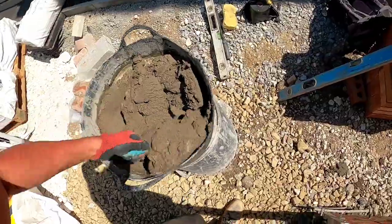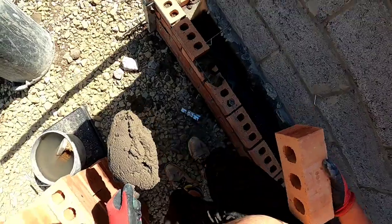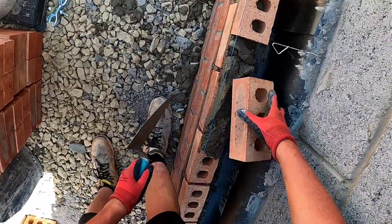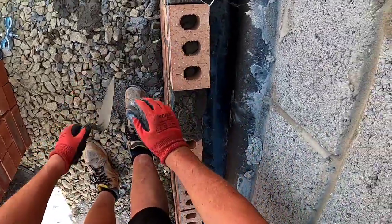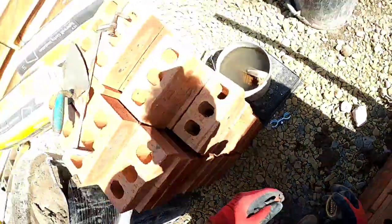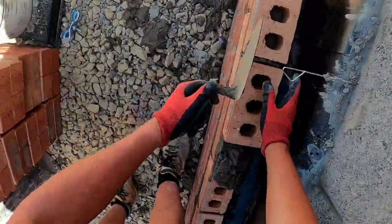Although people don't want to admit it — if you're putting furrows in your mortar, you're allowing the mortar to squeeze out both sides and basically into the cavity. And you've got a limit now, especially on new build houses, especially on these social houses — these are housing association — you've got to limit the amount of mortar that goes into the cavity to stop moisture bridging. Especially on open cavity, but obviously this is full fill, and that is what the NHBC want to see: clean cavities.